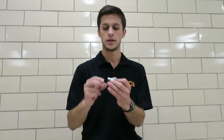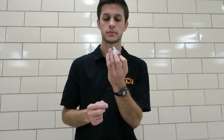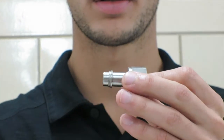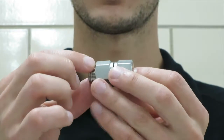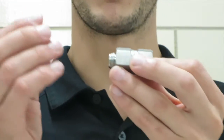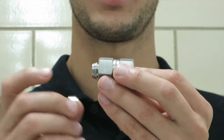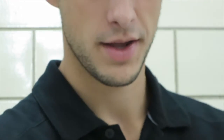There are a couple of pieces of tubing on the sterilizer. To pre-swage the other end, first install your nut. Then install the small ferrule — it has a taper to it, and the larger OD goes on first, taper facing out toward the end of the tube. Then put the big ferrule on. You have to get these the right way or it won't pre-swage correctly. The taper is always towards the end of the tube. You can let them fall into place, and now it's ready to pre-swage.